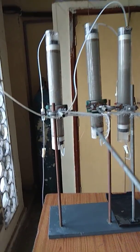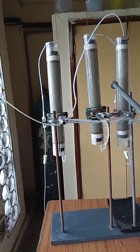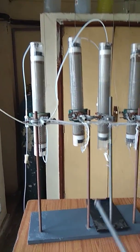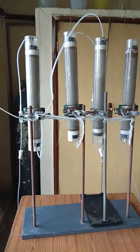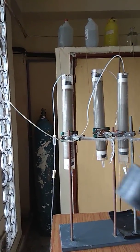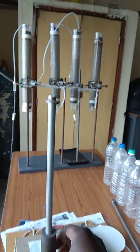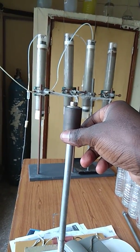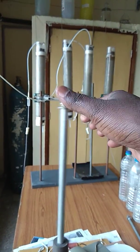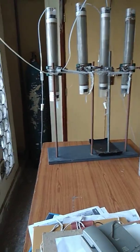I divided the 860 grams of fly ash — the mass determined in my pre-determination — into five equal portions. Then I started compacting each portion. I use a rammer, as you can see here. You place the bigger bottom part of the rammer on top of each portion, then you raise the load — which for the five centimeter column is 125 grams — and release it from a height of 20 centimeters. You do this three times per layer.